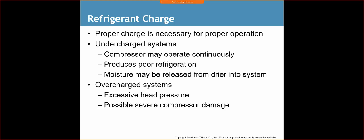Once we get a crack in the heat exchanger, generally that system is done for, unless you really want to replace the heat exchanger, and we then in turn replace the system. So it can be a very costly repair. It also shortens the lifespan of the equipment, and it's not energy friendly. So yet again, I'd almost rather have something that's a little bit undersized than oversized.